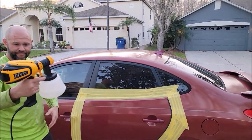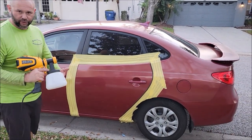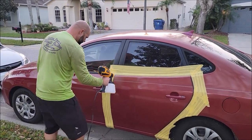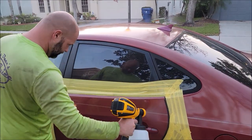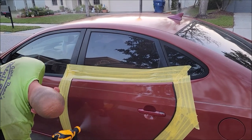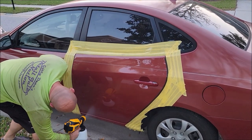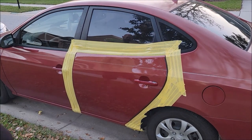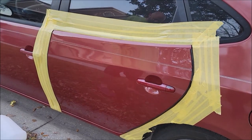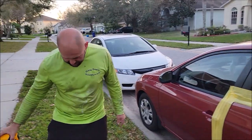I'm testing out this electric sprayer. I've got the Versacote 13 mixed up 50-50 with acetone. Wow, so now we need to give it about 15 minutes to do its thing — self-level and all of that. I put a total of 8 ounces in here and I barely used any of it, and it's stupid glossy.